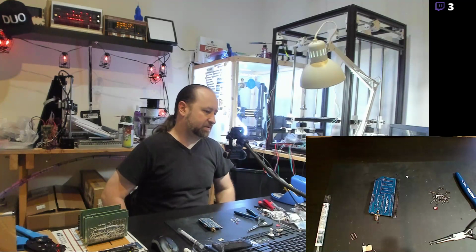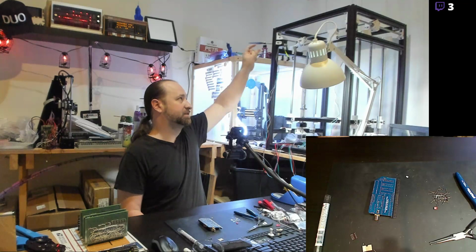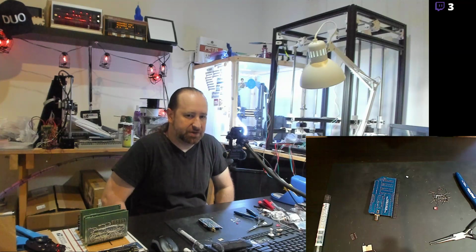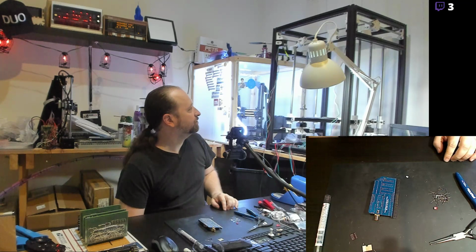And there are people that have replaced the rods that are on it with linear rail. The linear rail mod actually raises up the carriage a little bit higher and gives you a little bit more Z room. But for the linear rail that I would need for this, I would probably need to spend close to $200 or $300, and I really don't want to do that when this setup actually works really well. Those rods are hardened chromed steel. They don't flex. They are super strong.